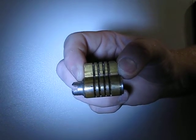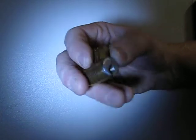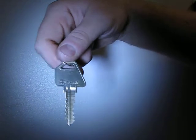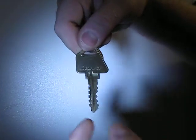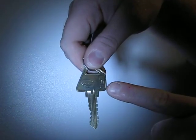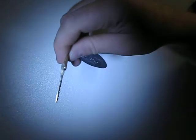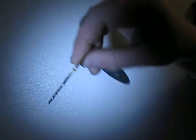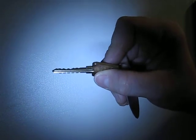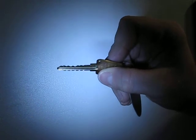This lock is probably a good 20-plus years old, if I had to guess — and that is a guess. So again, that's an Emhart cylinder with a Corbin 70 keyway. You can see here it says Emhart, as does the back of the key, with these notches. The old Corbin logo, which makes this a classic, as they no longer use that. The interlocking pins — to give you an idea of what's there. I'm hoping you can see that it's cut at an angle. These are cut at 20 degrees; Medeco is usually 15 degrees for their biaxial keyways. Hopefully I'll have some more cutaway or other unique locks to show you. So that's it.